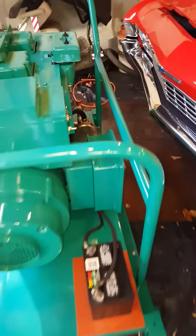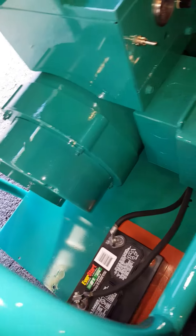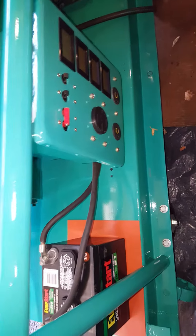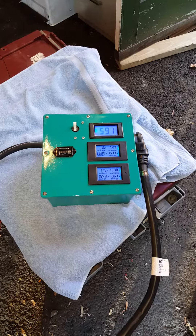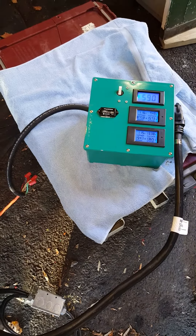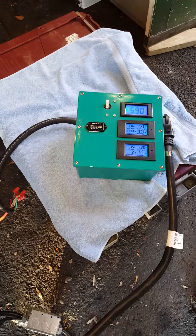On the JC that I was testing on before, I got the same Hertz meter — it is next to the generator head — but who knows, maybe there's better shielding, I don't know. But the bottom line is, without a doubt, my problem that I've been trying to track down is caused by the fact that the box is too close to the generator head. RFI seems to be the problem. I believe that's what it is. Thank you very much for the tip.